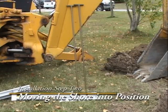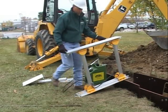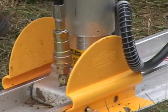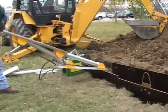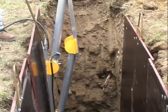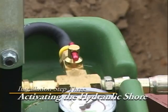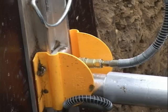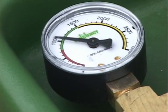Two different tools will help you position the shore: the release tool and the removal hook. Lay the shore down with the fitting side of the cylinder next to the ground. The hose fitting will slide over the quick coupler fitting on the cylinder. Place the release tool under the handle and fold the shore down. Pick up the handle and the release tool and walk the shore into the trench. After the shore is properly positioned, close the quarter turn valve and begin pumping the fluid into the cylinder until the pressure gauge reads into the green area, or approximately 750 psi.